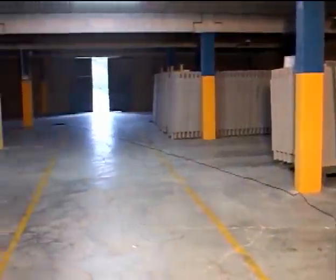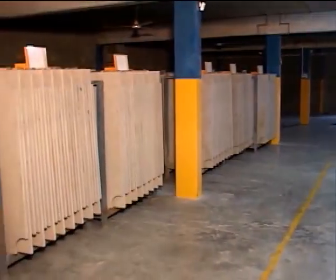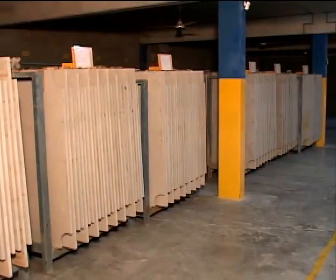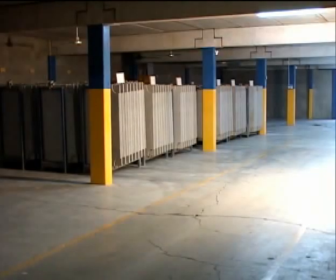Next, each set of slate is moved to a temperature and humidity controlled curing room for thirty days, where the slate is allowed to stabilize. Each group of slate is marked and monitored over the thirty days. Brunswick's thirty-day curing process to help stabilize the slate is believed to be unique in the industry. This process helps prevent crowning and fluctuations in the natural material.